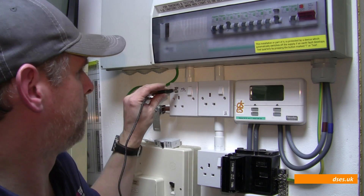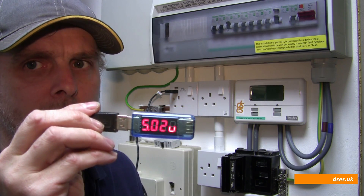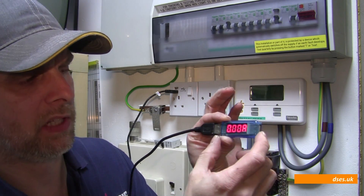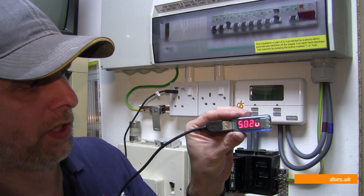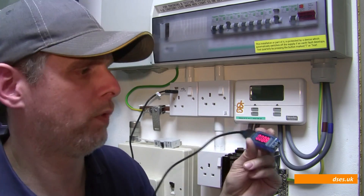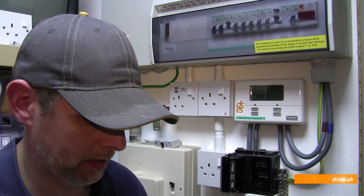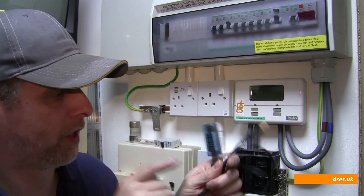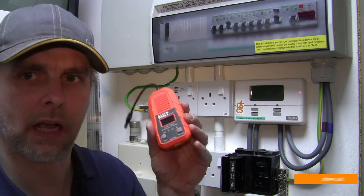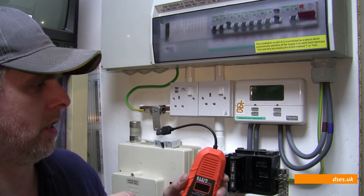This thing here is something a lot more simple. If I plug it into my socket it gives me a voltage reading and then it'll flick over to a current reading. The current is going to be zero because there's nothing passing through it. But if I were to connect a load, this thing would sit between the supply and the load and tell me what the supply voltage is — around the five volt mark as we expect — and what the load current passing through it is. Which can be nice for diagnostic purposes. Very basic, fairly effective, does what it says on the tin, cost about a fiver. You can get cleverer versions with a dot matrix LCD display which gives you more information, probably the same sort of information as the Klein, except the Klein has an additional function which allows us to put things actually under a load test.